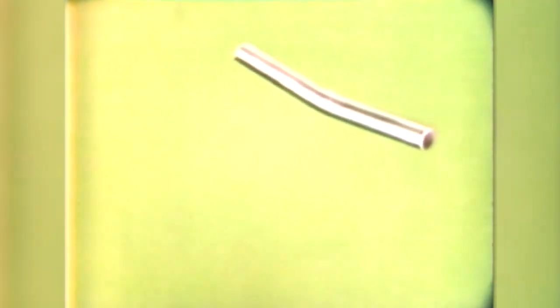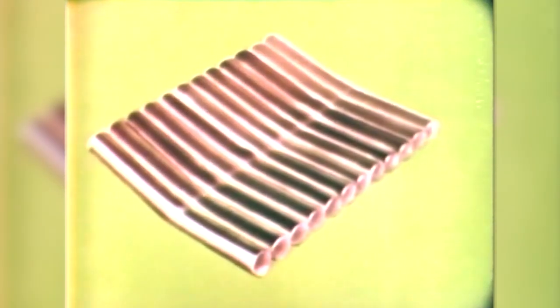Now, several steel bars side by side is much the same as a steel plate, showing that uncontrolled contraction always causes distortion. Let's see what actually happens when we make this butt weld. Keep the picture of that steel bar in mind, because the bar's behavior when heated is very similar to the weld bead that will form to join these two plates. As the weld progresses, we can see that the molten weld metal begins to cool and contract immediately, while at the same time, the heat of the arc itself is causing considerable expansion ahead of the contraction.